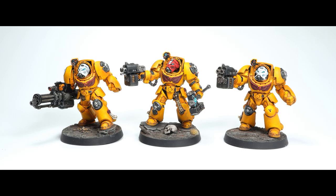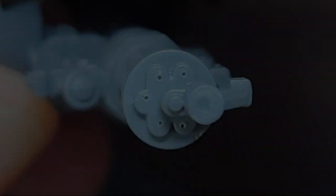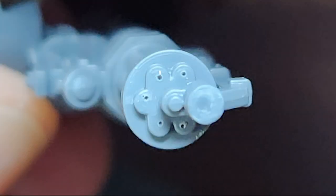However, there is an easy way to avoid this. You can reduce the chance of errors and give nice, crisp holes in your gun barrels by using pilot holes. Pilot holes are just pre-drilled holes in a surface that give the drill bit something to bite into, so it's not sliding around on a smooth surface, potentially creating a gouge.